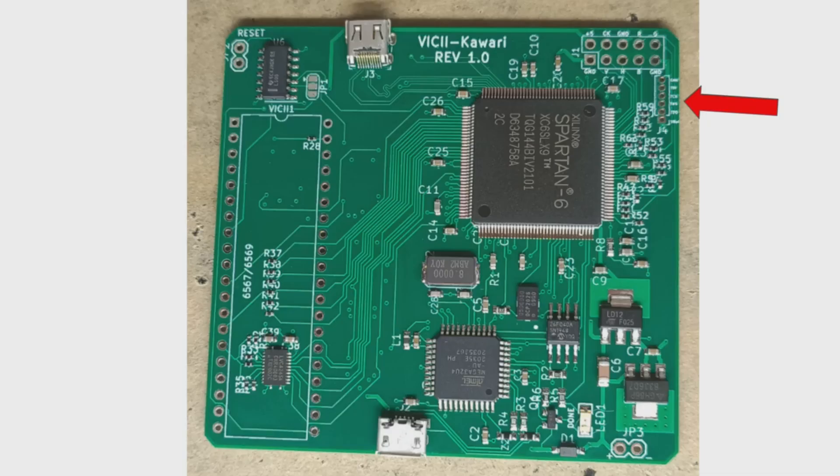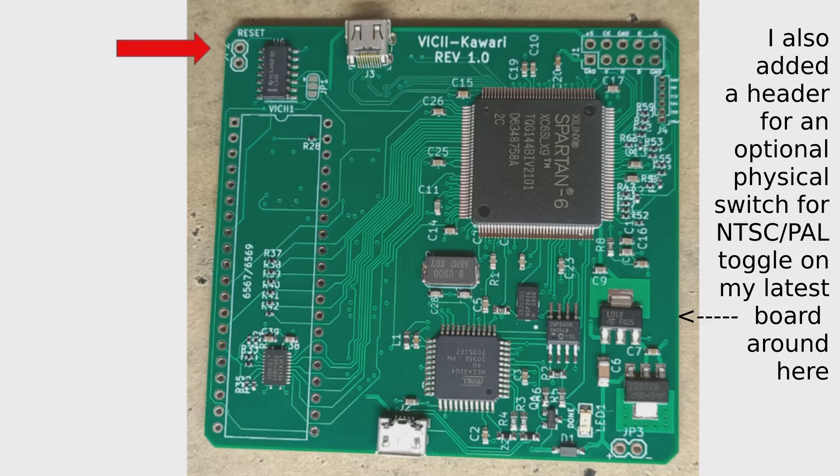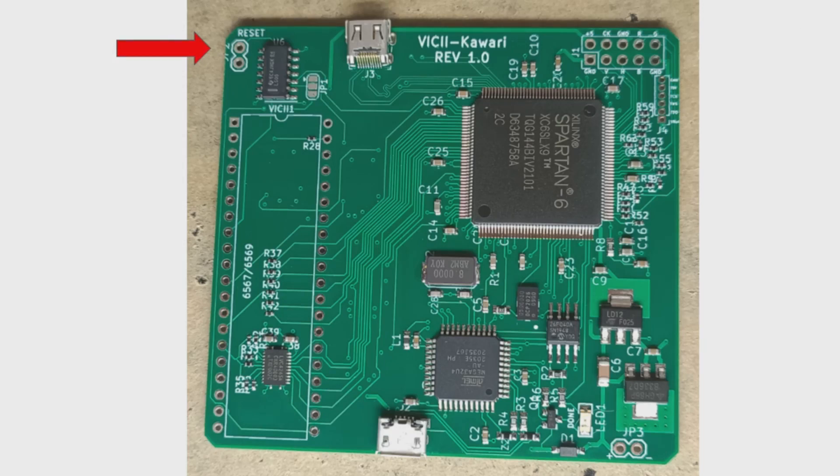There's a JTAG header on the right. At the bottom of the board there's a USB connector for flashing the device and talking to the microcontroller through a serial program, but like I said, that's going away. The MCU is replaced by a single EEPROM for saving and restoring settings. There's also a reset line that hooks onto the CPU's reset pin — to keep the system in reset while the bitstream loads, and to reset high-res video modes or put color registers back to defaults. The final board should load the bitstream in less time than it takes for the reset line to go high at startup, so the reset line should be optional.